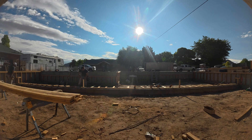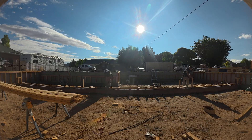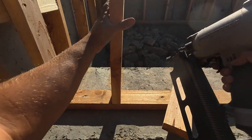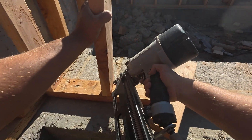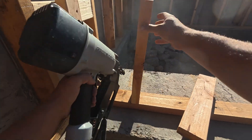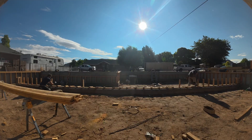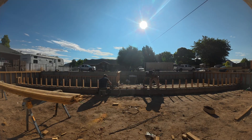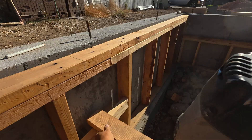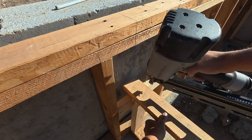Make sure all your boards are sitting flat and they're all being held level. I'm gonna mark these with the chalk line then I'm gonna square them, and you can see my dad following me cutting each and every single one of them. Now I'm gonna use eight-penny ring-shank nails — I'm gonna put in four to five nails in each, three on one side and two on the other. This top plate doesn't have any markings on it so far, we're literally just gonna shoot this end nail in and it's gonna land wherever it lands.